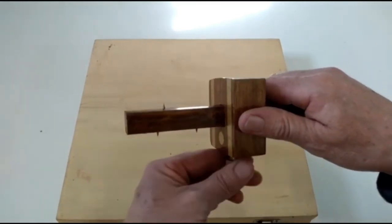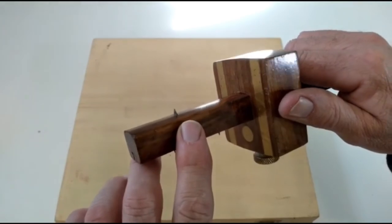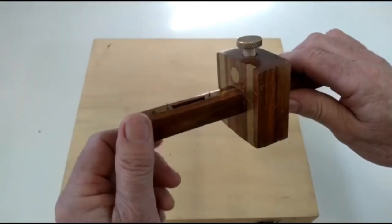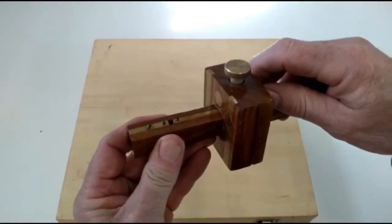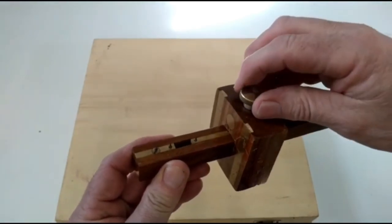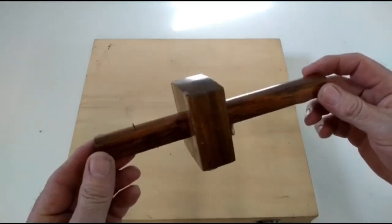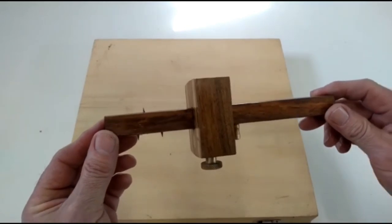Now, you'll notice on one side of the beam we have a single fixed pin for marking your woodworking joints. On the other side of the beam, we have a single fixed pin with an adjustable one. This is for your mortise joints. Now this particular gauge is a combination of a marking gauge and a mortise gauge. We'll cover the uses of these in the next video.